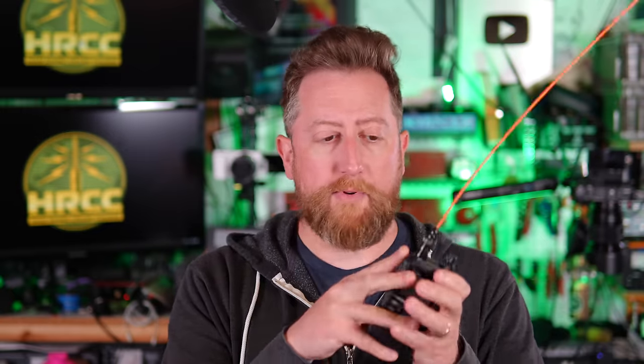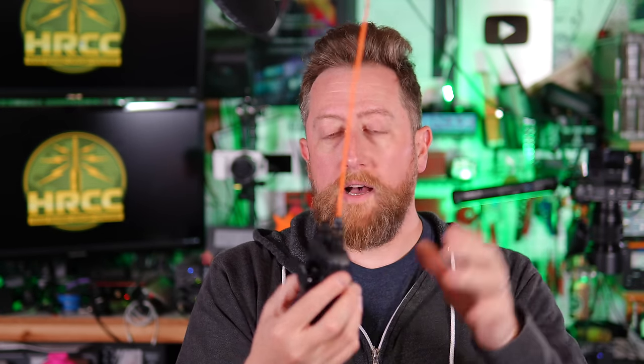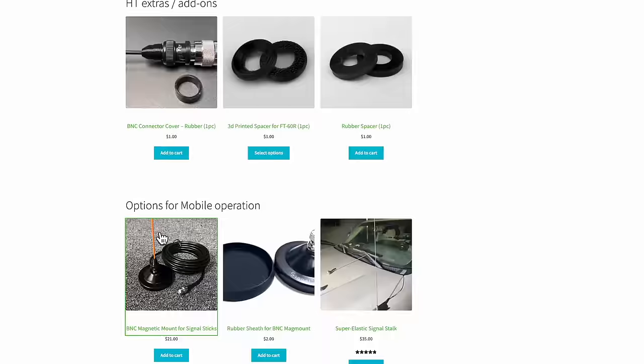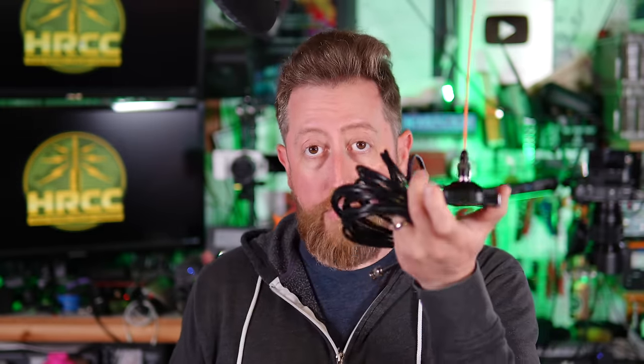Also bring a roll-up J-Pole like you carry with the 705 for your handheld. People often ask me, 'I just bought a handheld, what should I upgrade?' The answer is always antenna. Regardless of which radio you get, cheaper or more expensive, get yourself a BNC adapter for the antenna port on your radio. BNC is a bayonet connector - you just twist it on and it's done. That means I can disconnect from the radio, bring in a magnetic roof mount, slap it on top of your rental car, put your antenna on, and throw that on top of your vehicle. The antenna, adapter, and mag mount are available at Signal Stuff. It's a really nice way to stay in comms while on the go.